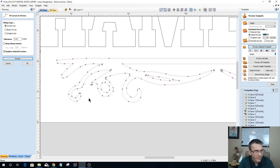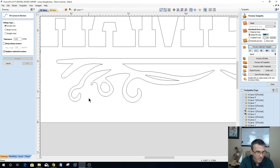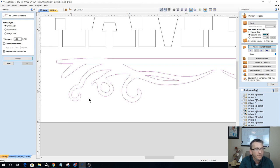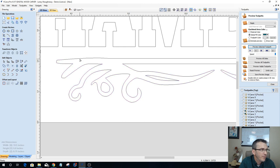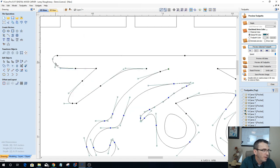And if we, oops. A little bit better. Got a little bit of a curvature there, but that's all right. Let's go into node editing. Let's take this guy here and delete those points right there, hit the letter D. And let's bring this one up to this one. Hit the letter Y on the keyboard. Oops, I brought that one down. Sorry. I want to select this last, hit the letter Y, bring that up. Put a little bit of an arc here.